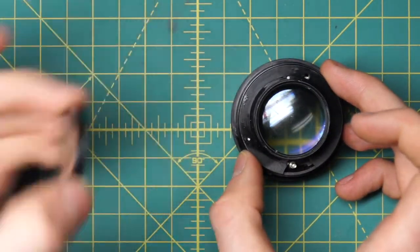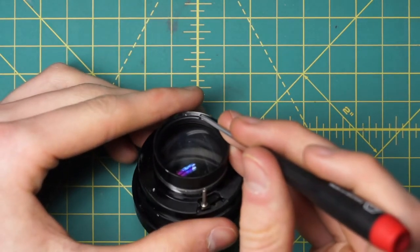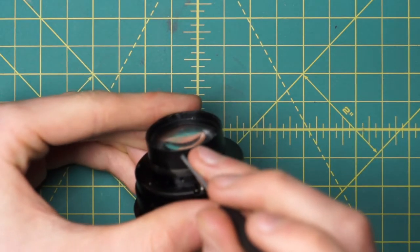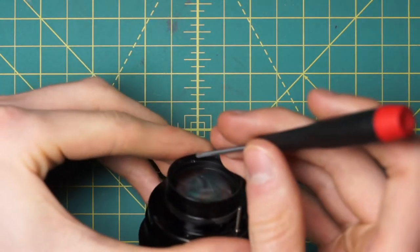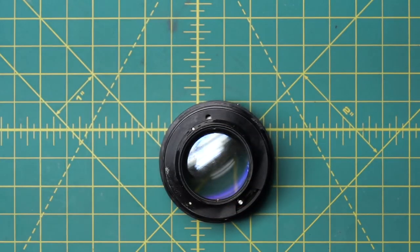There's the first tiny element. Next up, there's another set of divots for a spanning wrench way down inside the lens. Because this is a convex lens element — you can see it's kind of sticking out — you want to be careful when using a spanning wrench here because it's easy to scratch the glass. The divots for the spanning wrench are actually below where the lens is sticking out, so make sure the spanning wrench is not resting on the glass before turning.